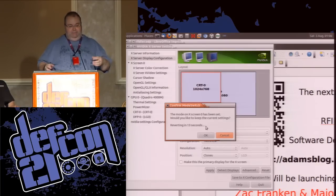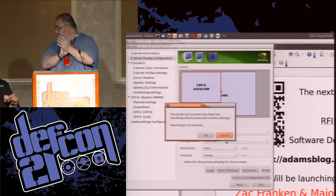Sometimes they're like spherical. So the question was, sometimes they're almost spherical. Does that impact the time to etch? And the answer is yes. Simply, the greater the depth of epoxy, the more time it takes. Well, you'll almost never be able to do this and get it right first time round. So expect to go through a few chips until you actually work out, okay, it's going to take X amount of time. And well done.